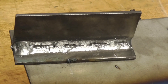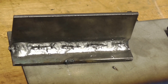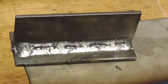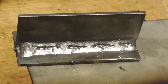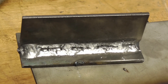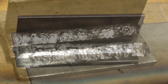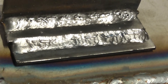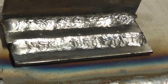Here's a look at the chicken tracks I got on the first weld when I fired up the flux core welder after it sat all summer — that is unacceptable, just too much. I'll show the other welds in progression from first to last before having the young woman do padding to run the wire off. The T-joint I did next had a huge amount of chicken tracks — that's rejectable. The lap joint had a little less but was still pretty bad — also rejectable.